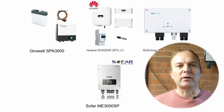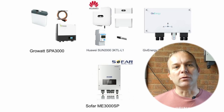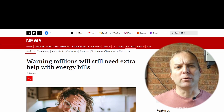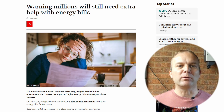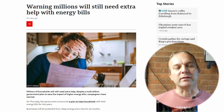Finally, that brings us to the SOFAR ME3000SP. This is a 3000W inverter charger which supports LiFePO4 batteries and doesn't require a registered installer or even an internet connection to work. The UK and most of Europe is in an energy crisis — UK electricity prices have quadrupled in less than a year, so everyone who can is trying to install solar and battery storage. This makes buying any ready-made battery almost impossible. I managed to find a used ME3000 unit on eBay, which was guaranteed as working and fully tested. So, time to do a bit of DIY and start clearing up the garage.